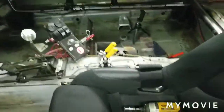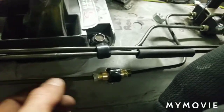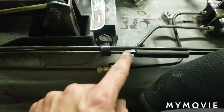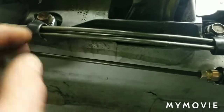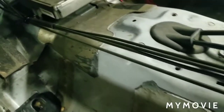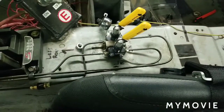Here's the finished product on the brakes. The video is all chopped up, but we've got this one mounted here that keeps this line rigid — this would be your outfeed for the back passenger. We have this clamp here and the split hose here to keep these two from vibrating. We come up here with another clamp, and we had to put a nut underneath as a spacer instead of cutting it out. The contour of the lines flowed that way so it made more sense to keep it up, then you just follow it right on up. We've got another clamp up there and they curve up and go right out the firewall through the grommet. Everything seems copacetic — I'm very happy with how that turned out.